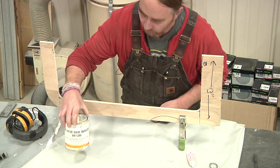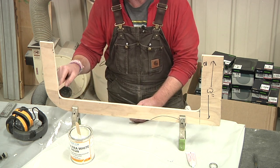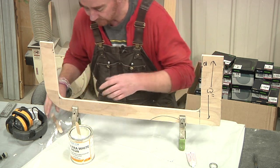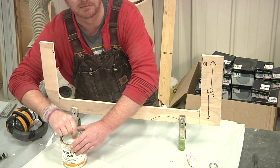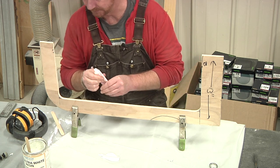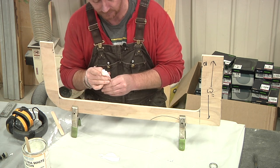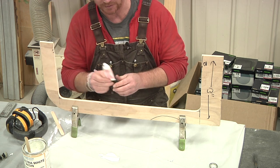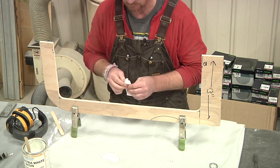Here's an oldie you haven't seen in a while — this is the old AdTech P14. I'm going to be using this for building up these radiuses. It's less than an eighth of an inch, but I'm going to actually overbuild it a little bit so that when I sand it to shape, I don't have to come back and do any touch-ups. The reason I'm using the P14 is because it's a quick-set compound — by the time I get this mixed up and laid down, it will be ready to sand in about 10 or 15 minutes. It uses a cream hardener, which is why it sets up so fast. If you don't have this — it can be kind of difficult to find — Bondo would work perfectly for this. Bondo is another cream hardener type compound. You're not looking to make a finished piece; this is strictly a template. So Bondo for something like this would be absolutely perfect as well.